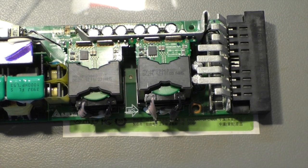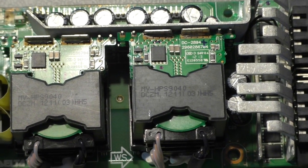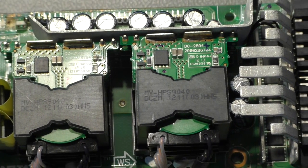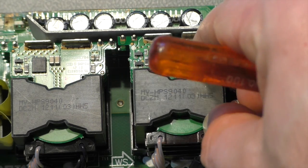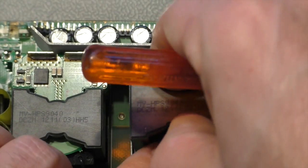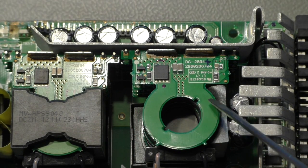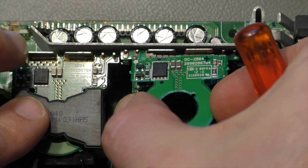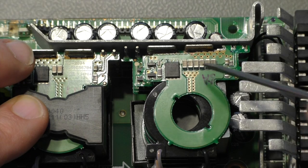Now let's see if we can get a little bit closer. As you can see, it's not really a transformer as you're used to seeing. They have chips and circuitry directly on the transformer coils, if you can call it that. So I cracked this one open so the core comes off — looks like that. As you can see, we have one turn here with a big MOSFET transistor. And if we turn it over, we have the same circuit on this side, plus some additional capacitors here.